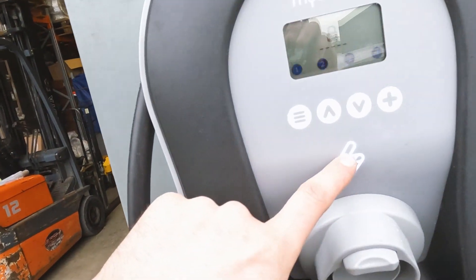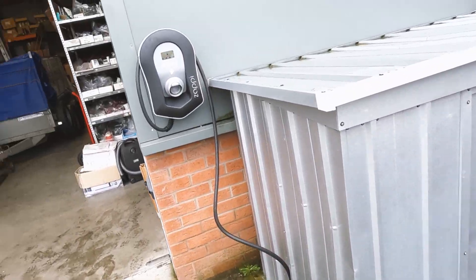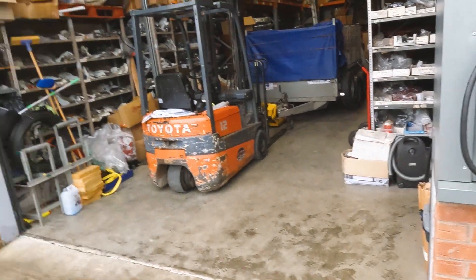Alright, it's all charging away then. You get a blue light when it's charging, a pink light when it's plugged in but not charging - and as you can see it's charging away on this electric car. You saw how we set up the CTs - we went in, made sure all the CTs were pulling and sensing power running through L1, L2, L3. We also changed the password so nobody's going to come up and start charging and nicking his power. That's all done - a nice, neat, sweet job really. If you like this kind of content, hit the like button, hit subscribe, hit the bell notification. As always, have one from me and I'll see you on the next one.